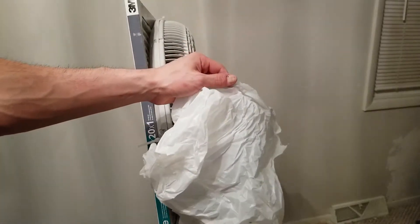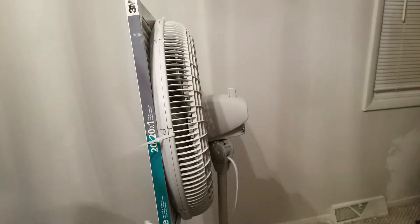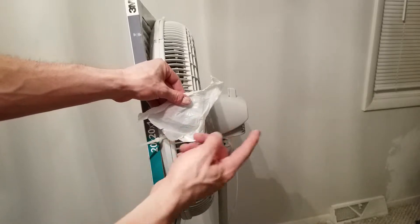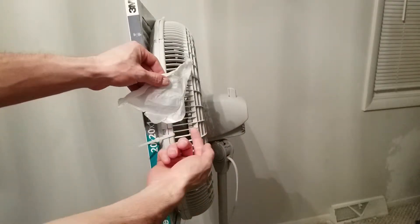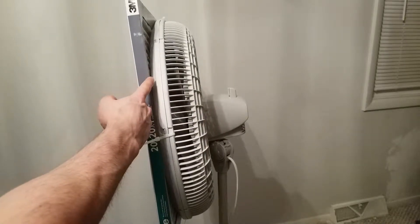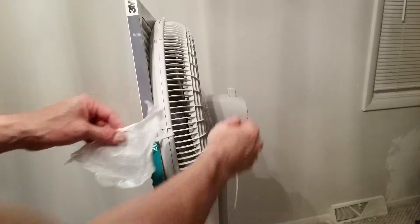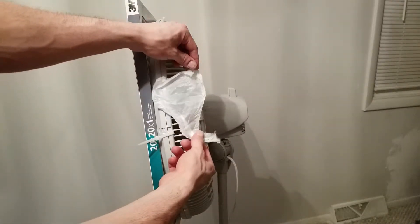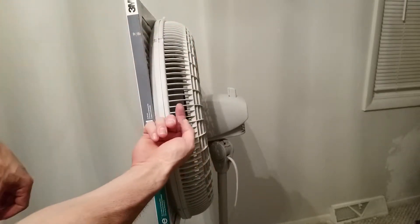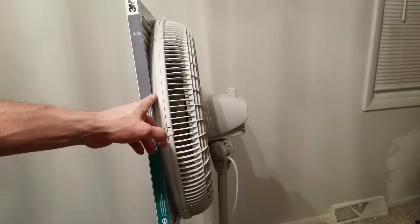To do that, I'm just going to get a plastic bag and rip off a portion of it. You're going to turn the fan on, put your bag right here, and see where the airflow is blowing it. If it's blowing it outward, then you're getting air leakage and there's too much resistance in the filter. As you can see, it's blowing the bag away — so we're getting a lot of air hitting the filter and immediately coming out the side, meaning not all the air is going through the filter.